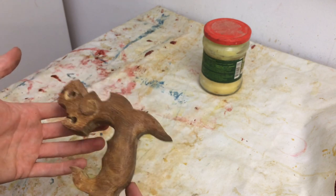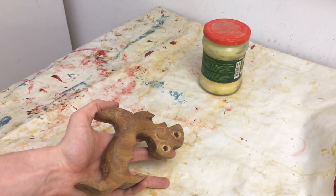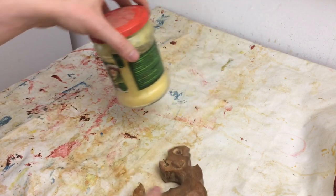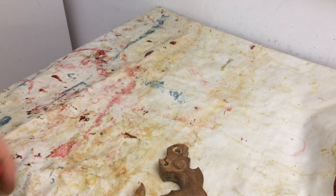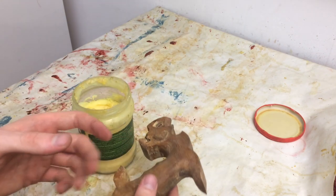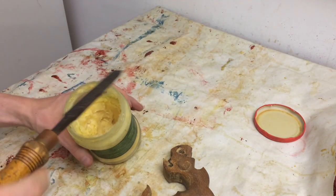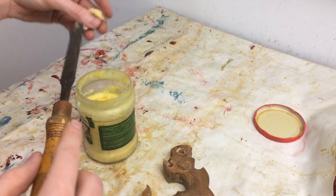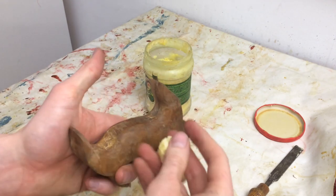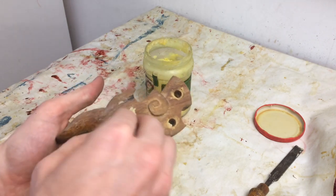It's time for finish. This wood is quite a lot darker already than all my other saw handles, so I'm not going to put linseed oil on it. Instead I'm just doing my beeswax polish, which has a little bit of linseed oil in it to make it dry. It doesn't darken the wood as much as the pure linseed oil and it makes it a little bit smoother as well, so I actually think it's more suitable for handles. I'm probably going to go through and wax all my old saw handles as well, just to give them that silky smooth surface finish.